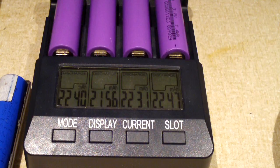Some of these UltraFire batteries are recycled laptop batteries that have been re-wrapped, and pretty much none of them can put out the capacity that they're actually rated for. Because some of them are rated for capacities way over what an 18650 can put out these days. I think the highest capacity 18650 out there is like 3,600 milliamp hours. There are UltraFire cells rated for 4,000 milliamp hours, and knockoff brands on eBay rated for 6,000 or even 9,900 milliamp hours — just absolutely crazy numbers.